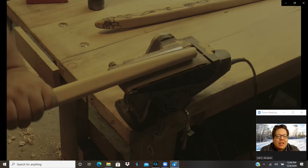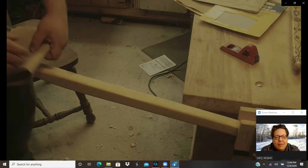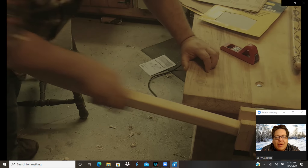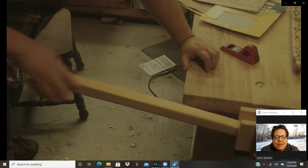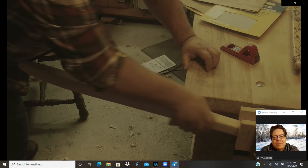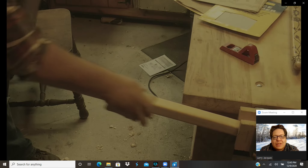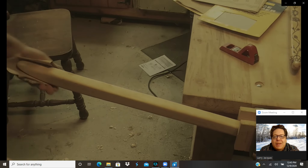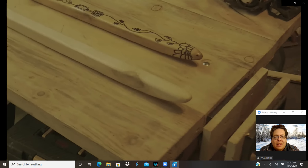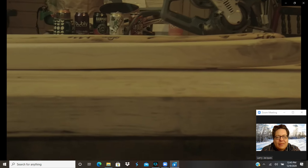There's that little break where I'm looking at the piece and stopping and saying, well, what do I need to do next? What's the next step of sanding? Ultimately, you get it sanded pretty good with the belt sander and you need to move to a different grit. I'm doing some hand sanding here, starting off with a 60 grit and knocking out some more variation. The hand gets to kind of fit around the material and you get to just give it another run of getting smoother and more level across the various surfaces. The grits go: 60, 100, 240, and ultimately we'll end up using some steel wool for that final pass.